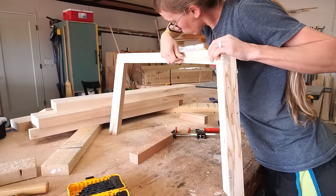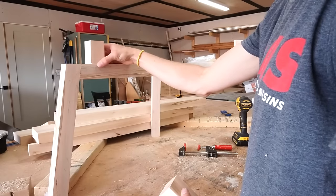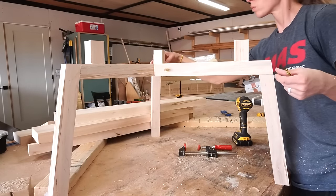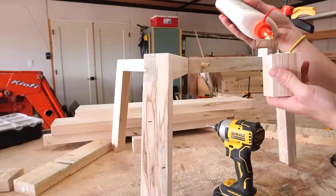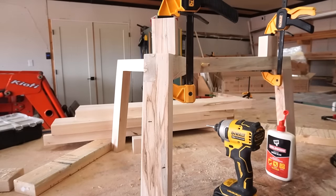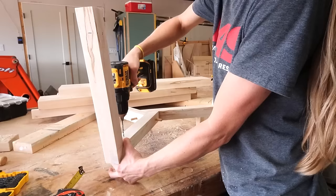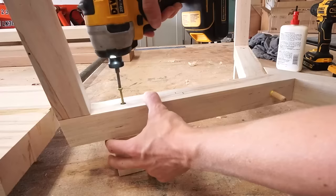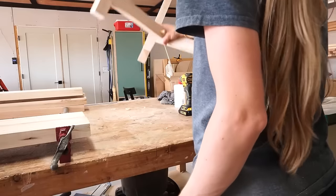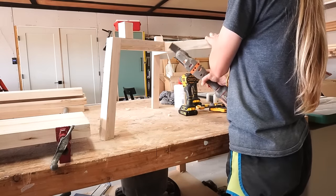The last part of the base was what I'm going to call risers. I cut three pieces of 2x2 about two and a half inches long and glued these on top of each leg, about two and a half inches in from the edge. Once the glue was dry I flipped this over and added a screw through the bottom for some extra security, then used my oscillating saw to flush-cut all of the dowel plugs.